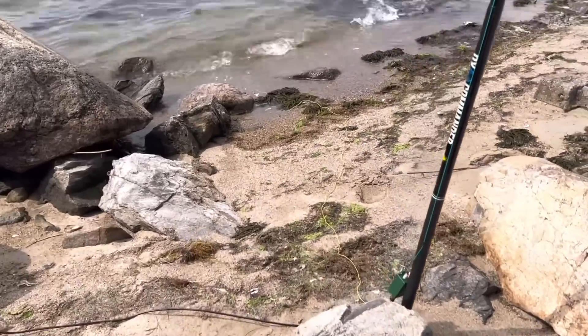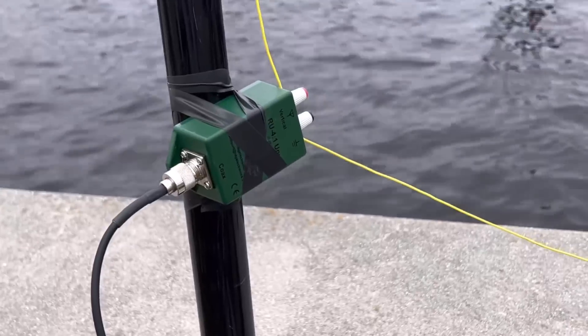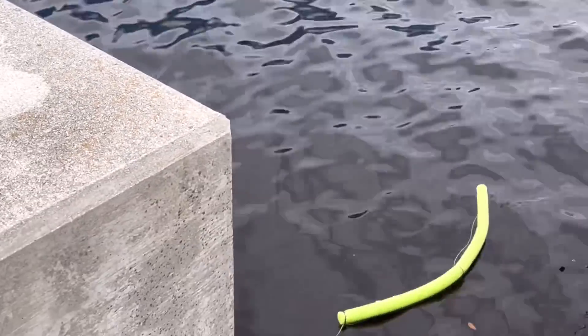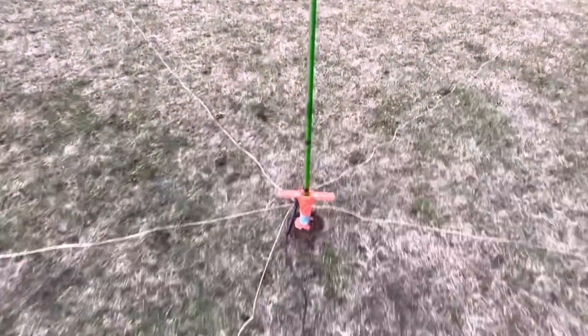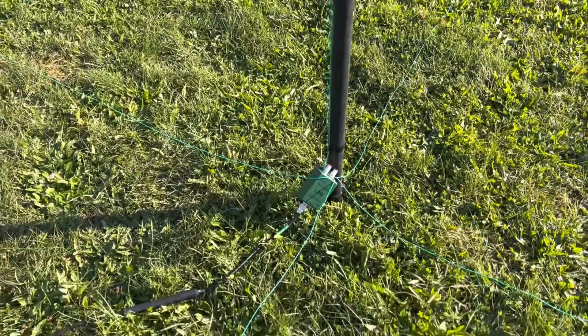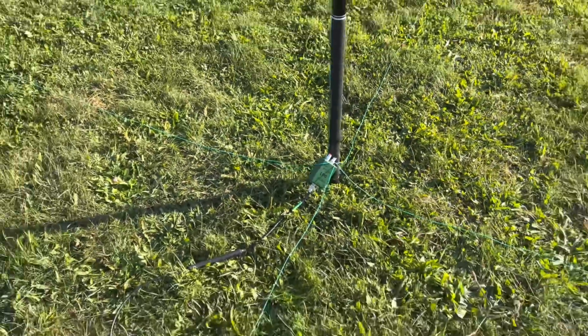A few of these antennas are going to require a ground plane underneath them. Typically with me, I operate by the beach a lot. I usually run one counterpoise wire — I don't worry about the length as long as it's long enough to kiss the edge of the water, and that works for me. For those not by the water, four to five counterpoise wires on the ground works. I try to put at least one wavelength of wire underneath it — so for a 20 meter band antenna, I try to put 20 meters of counterpoise wire total, like four or five meter long wires. The length really isn't important if they're on the ground.